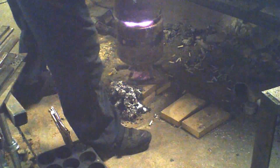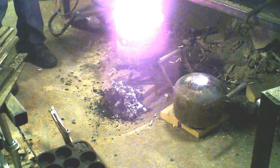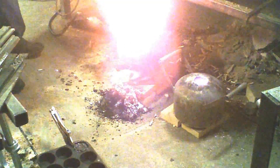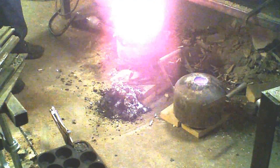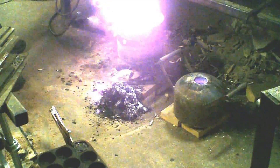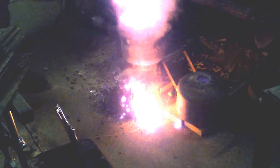Now with the noise turned off — this is baking soda in aluminum foil. Put it in there and push it down. That's degassing. When you degas it, you're going to get more and more slag. I had the top all nice and shiny, then I degassed it, and look at all the extra slag that came up.